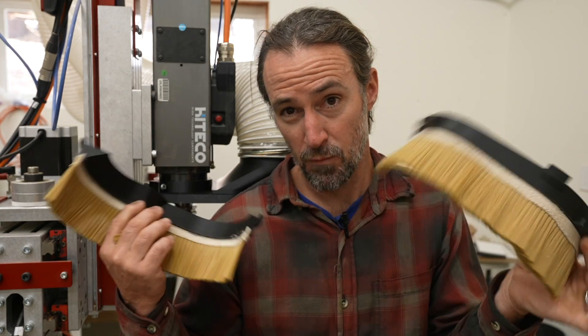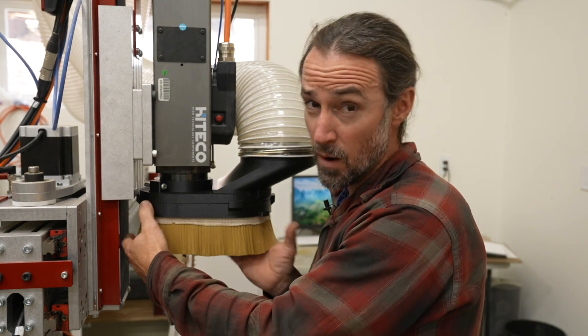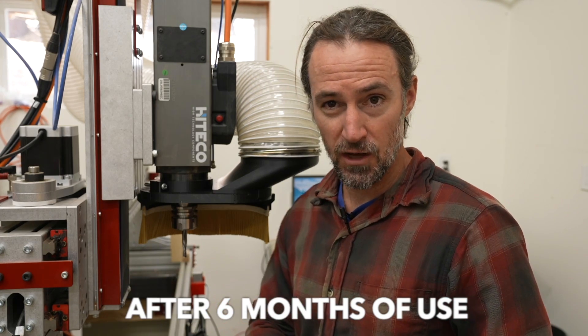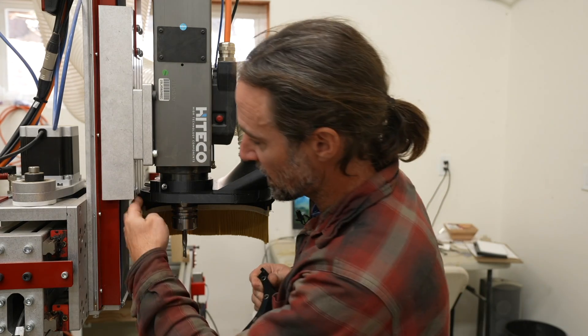I did a split design for my dust hood for a couple of reasons. I could have the back half on, take the front half off, and do a manual tool change if I need to. But I can also actually start a cut with just the back half on, get some dust collection going, and then slip on the front half relatively safely and get good dust collection again. One of the problems I had with my first dust hood was no latch points to keep it from getting pushed off — eventually my original one did get pushed off and got chewed up a little bit.